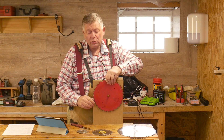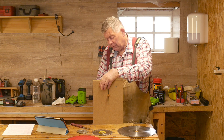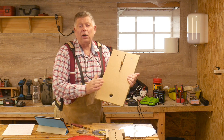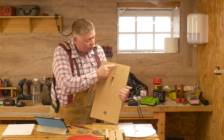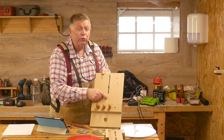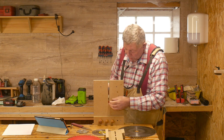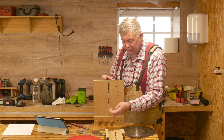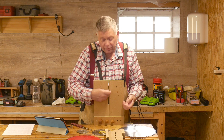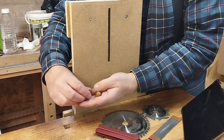The jig consists of two basic parts, so let's dismantle it and see what we've got. The first part to make is this upright mounting board. It has a slot which accommodates different diameters of blade, a hanging hole, and on the back it's got a groove. This takes a flange nut which moves up and down. My different sized spigots screw into that through this slot. So for my 10 inch table saw blade with a 5 eighths bore, it goes in like that, and I can adjust the height for the diameter of the blade.